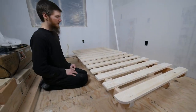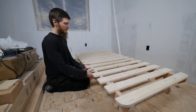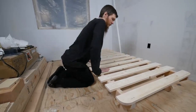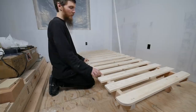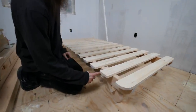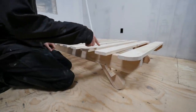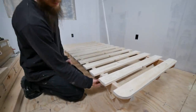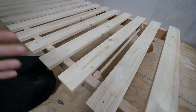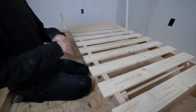If boards have a twist, the dowels don't pull them down — they just hold things side to side. It's held in with the dowel, and that's my little mess-up right there. Just holes, dowels, and gravity keeps it from sliding out. If I was doing it again, screws would just speed up the whole process so fast.